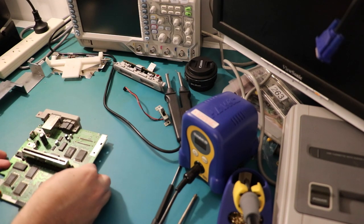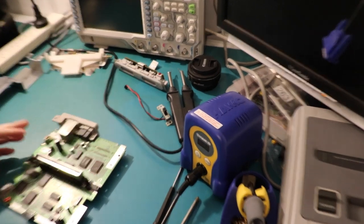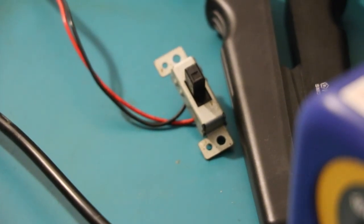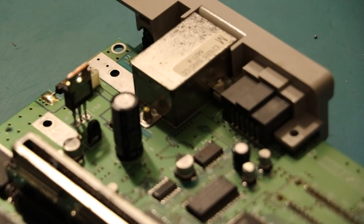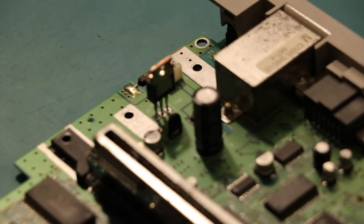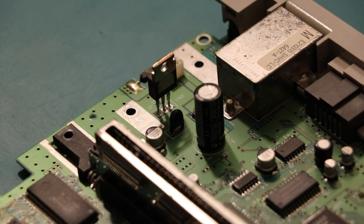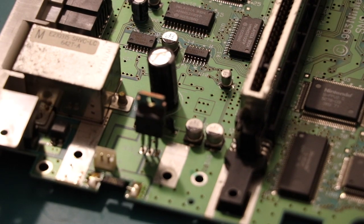All right, well, I'll flip this over. So you've just got to note some things before you go ahead and do anything. One is that is the power switch. Oh, there we go. There he is, little 7805. So we'll be ripping him out.